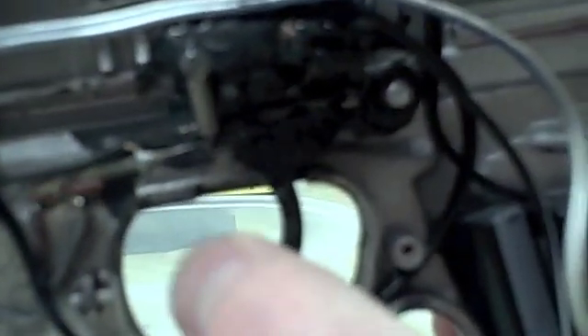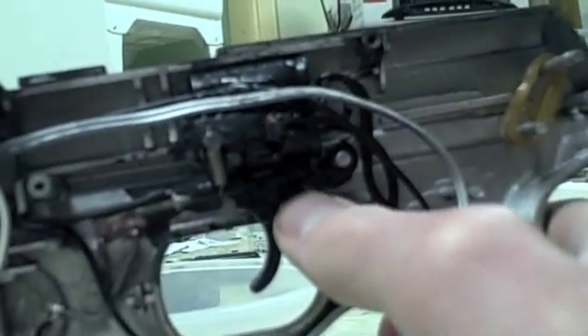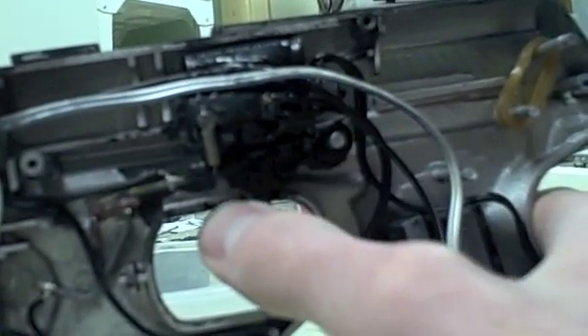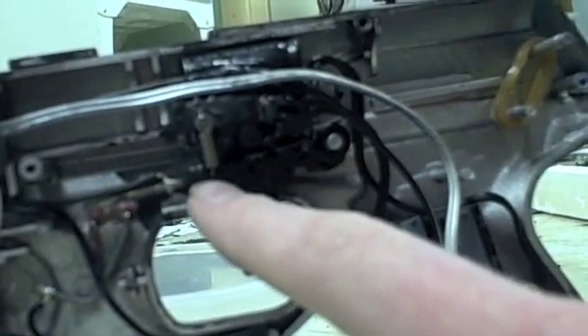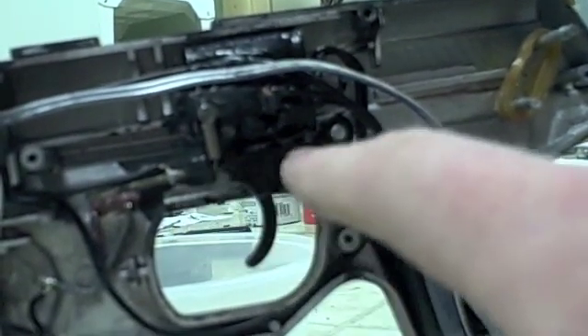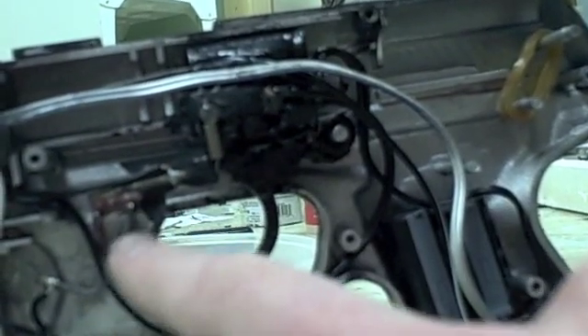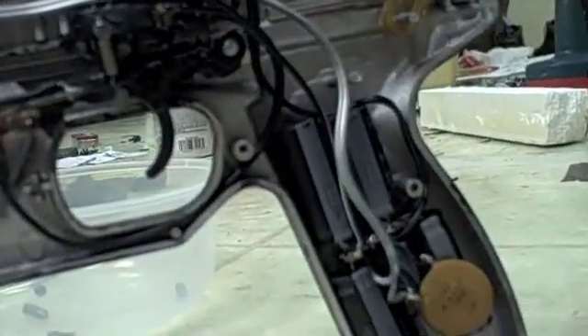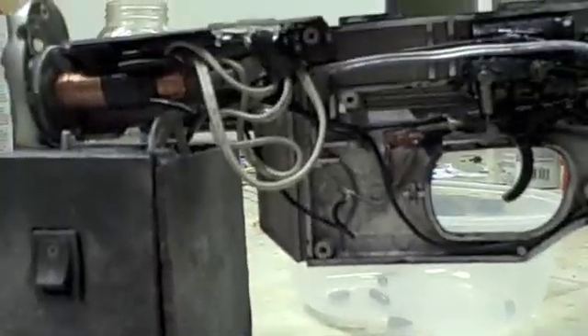This is my trigger system — the trigger from the standard gun, and this is the joint from the standard gun that was here. I attached it with some epoxy and wrapped some thread around it, then spray painted it to seal it up. I've got a little pull spring that goes down to this rod coming out, and then another rod right here, which connects to the other wire. So the circuit overall is just one wire goes from the capacitors to the coil, another wire comes from the coil to the bottom of the switch, top of the switch, back to the capacitors — a pretty simple setup.